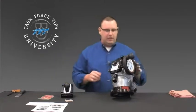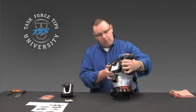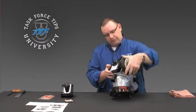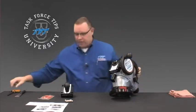We've got a BIV here that we're going to switch around. The first step is to go ahead and move it to the open position, so we'll go ahead and crank that — it's in a closed position right now. Once we're in the open position, we'll go ahead and use a 5/16ths Allen wrench.